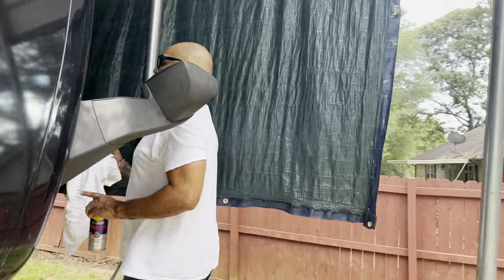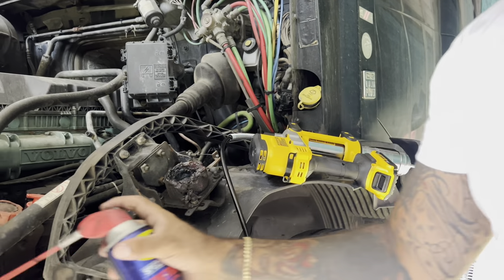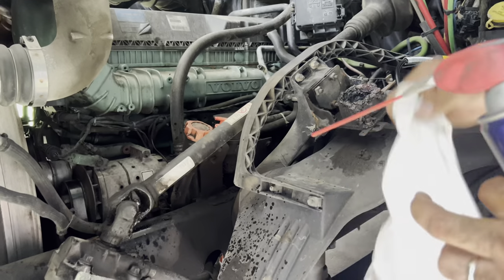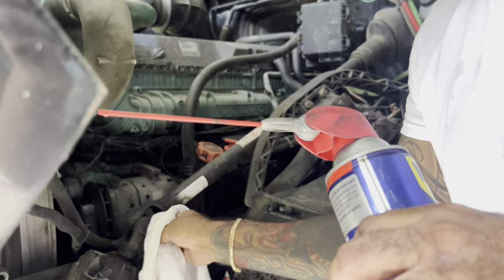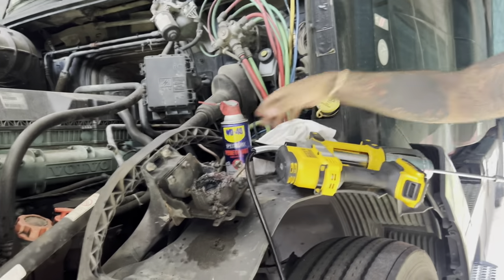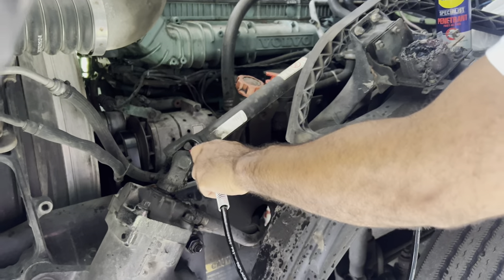The first thing you're supposed to do — I'll start from here — always clean your grease fittings. You have no idea how many of them I've broken. It's not hard to take off the grease gun, but it's annoying. You're definitely going to need some type of pliers or needle-nose to get them off, but I always clean them out so I won't break them. Stick it in, press — boom. Real quick, as y'all can see, that old grease came out.